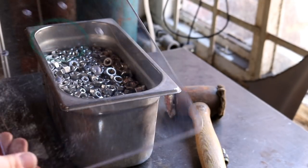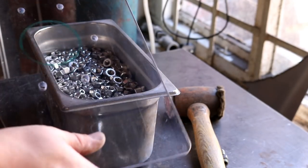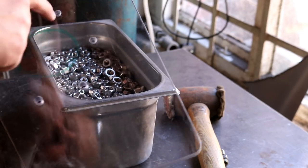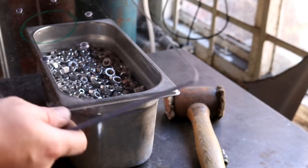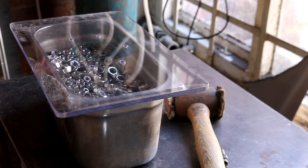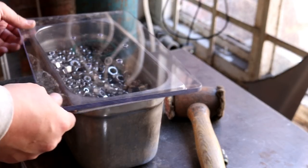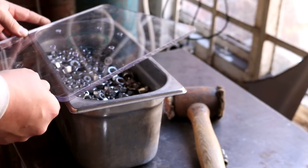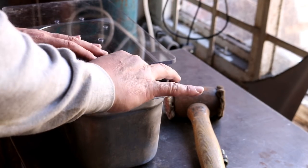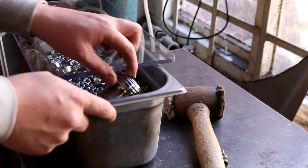So quite conveniently, I've got a piece of 10mm, 8mm perspex that I wanted to use to make a router table, and I shot through on a couple of the holes, so I ruined it, I had to do it again. But that will make a good lid, so when we've got the argon in there, I've got it flowing at 5 litres per minute. Once it's filled up, all we have to do then is just kind of slide it back a little. Drop our part in and commence the weld, I think.